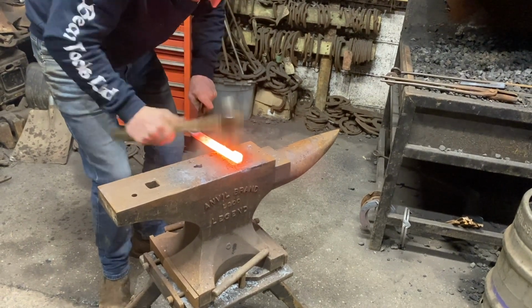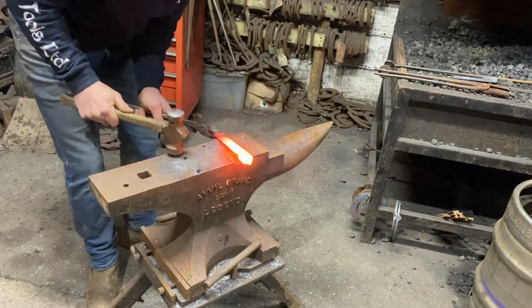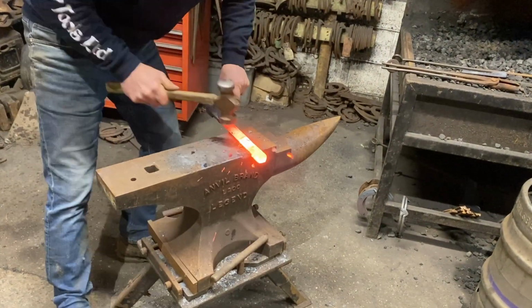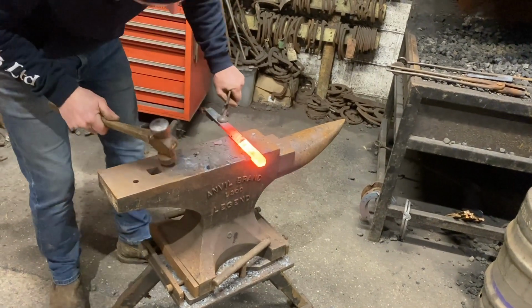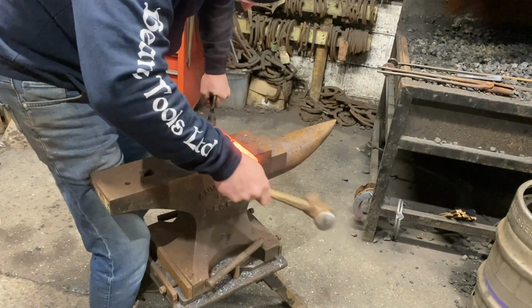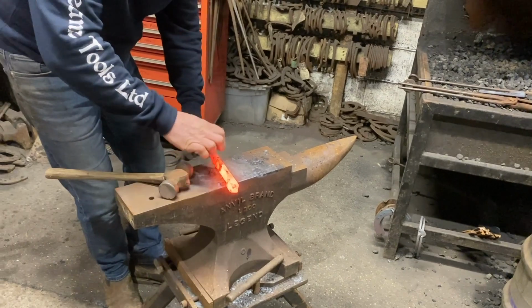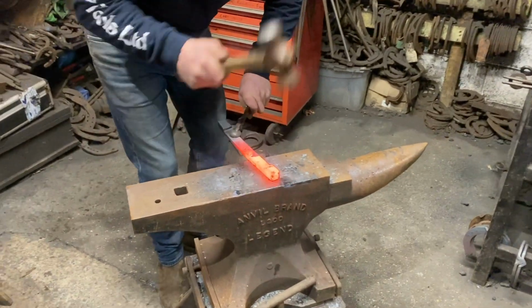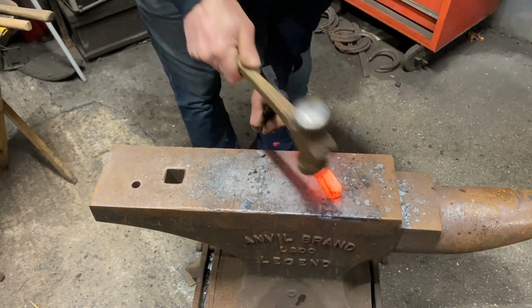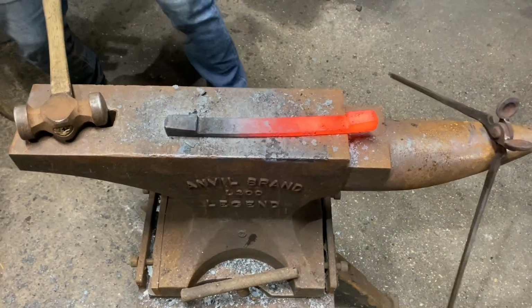Bring the front down. Edge of the handle. I'm just bringing that back so my hand's nice and flat and this hand's parallel there. So in front of the shoe I want it the same thickness, I don't want it set down. It's not a caulking wedge. And that's a nice little Spavin heel, so let's just mark our toe on that.